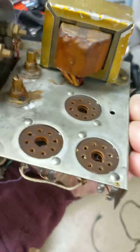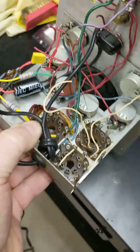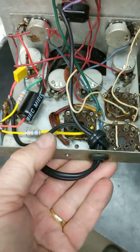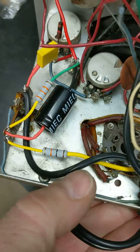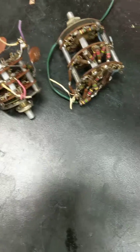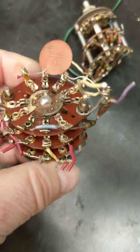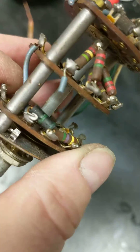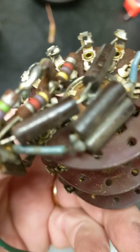I had to get the schematics. I've got the tubes out of it. I had originally started recapping it and re-resistoring it, and as I started getting into it and comparing it to the schematic, it wasn't even close. I have a new power cord on it right now, a new electrolytic capacitor, and such. There are two main rotary switches. I'll put some new caps on there as required, re-wired as required. I have to change all of the resistors that are composition — if they're wire-wounds. I think these appear to be wire-wounds.